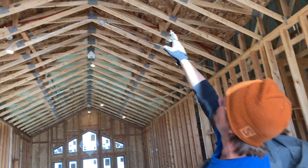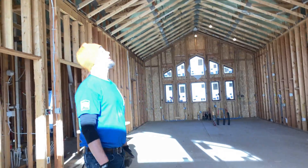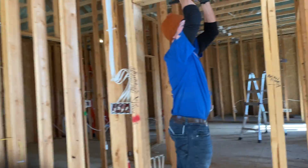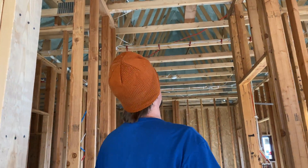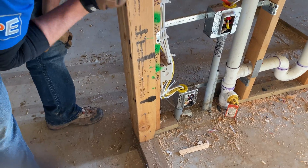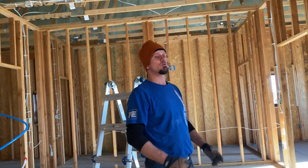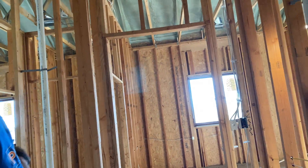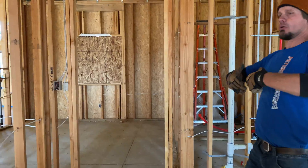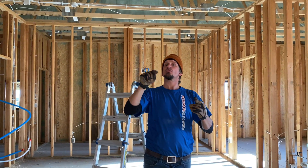We've got these nice Arlington boxes that are flat — they work for ceiling fan, a dining sink, and an entry light that needs to be flat as I come into an A-frame. We have outside eaves that are newer trims. The only thing I don't understand about this house is it has the shortest doors I've ever seen in my life — I'm 5'9" and all the walls are super high. Coming in here, the last two PVC boxes came into this area. These were essential circuits, these were non-essential. We did watch our box fill. I used four and eleven-sixteenth boxes with one-inch knockouts, which made it easier. You've got bedroom, bedroom, Jack-and-Jill bath, bedroom, bedroom, Jack-and-Jill bath. This living room area is on emergency — if the power goes out, kids can play and sit there and that wall stays hot. These lights are hot. All the rest of it dies. Smoke detectors are on arc fault but also on emergency backup as well.